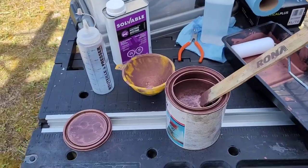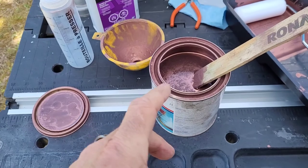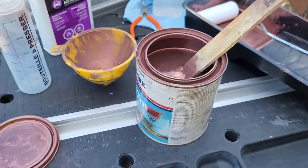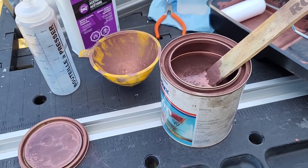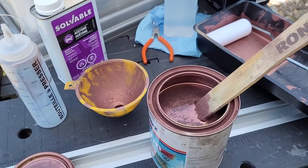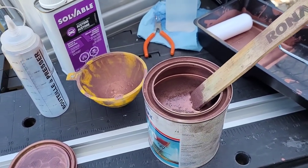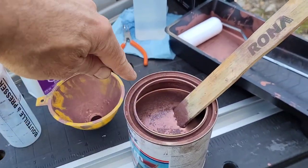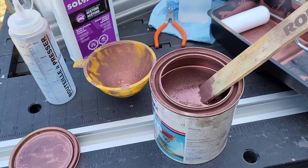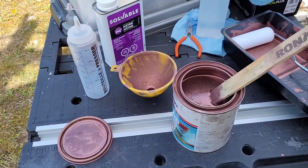Now I'm going to go mix the anti-fouling. I just got back from our working barn at the Yacht Club. I didn't film the mixing because I have to wear gloves and a mask — the VC-17 has a copper powder component. There's a blue cover that goes on top of the can. Once you open the copper pouch, you need gloves and a mask because it's volatile and the fine copper dust is not good to breathe. The can has about an inch of space below the fill level so that when you pour in the copper pouch, it fills the can. I close the lid and put the blue cover back on to keep any powder from going everywhere. Once it's mixed, I use the funnel to pour it into the squeeze bottle so I can apply it around the boat as needed.